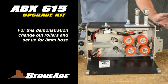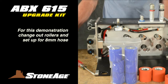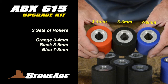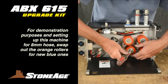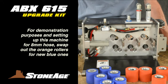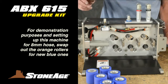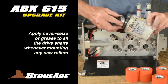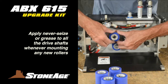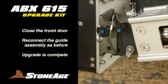If you haven't already done it, remove the last four drive rollers at this time. Since we've been setting up this example for 8mm hose, we'll swap out the orange rollers for the blue ones from your kit. You should have three sets of drive rollers now, each set to be used specifically with different hose sizes. Normally, you wouldn't choose the rollers and hose collet stop until you knew the specs for the particular job at hand. Before replacing the new rollers, apply never-seize or grease to the drive shafts as shown. Slide the new rollers on, matching the keyway with the key. The spring button will automatically lock the roller in place. With the new rollers on, close the door and hook up the guide assembly using the method shown before.